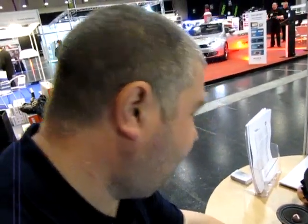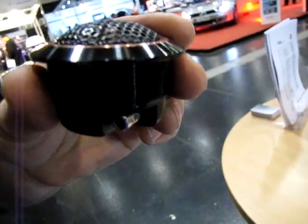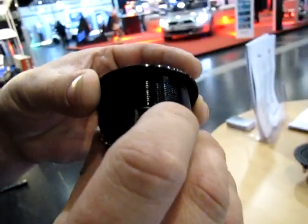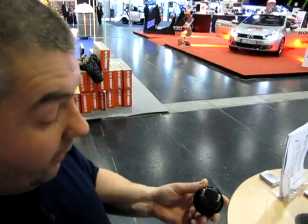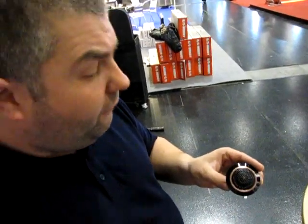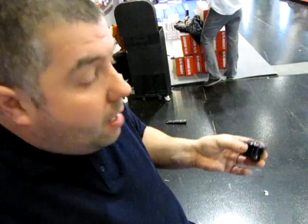Wow, that's serious. Let's have a look at that ring radiator tweeter — I'm kinky for high frequencies. This is the new R2 ring radiator tweeter from Hybrid. Again, you've got a copper phase plug producing the ring radiator effect. You also have a copper surround here to match the aesthetics of the line. One of the nice things is the entire tweeter body is machined as an M46 thread, and there's an M46 nut that screws up so you bolt it to your baffle of your choice. You can have anything from two millimetre to fifteen millimetre as a baffle thickness. Fully enclosed, you also have push terminals on the tweeter. This tweeter can actually play as low as one and a half K all the way up to thirty K plus. So you can run it either in a two-way system with a very wide bandwidth with an L6 SE or even an L8 SE off-axis, or you can run it in a three-way system and even cross it up as high as 12 or 14 K and it'll still integrate well.